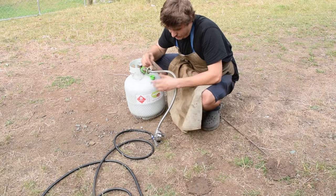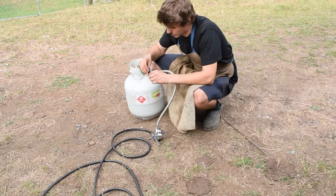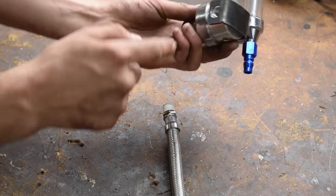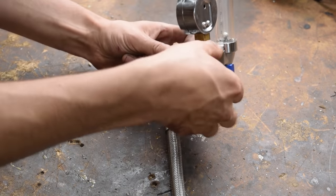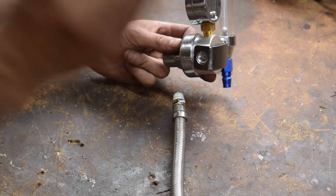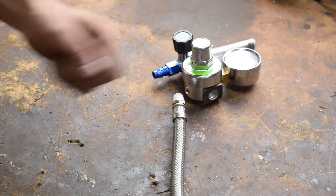The last thing to solve is the regulator — it's been sitting on the ground for testing. I'm going to make a bracket that lets it clip to the top of the tank. The bracket is held in by the threads on each side through a hole. It will be loosely fitting, which is actually good because we can thread the BSP fittings properly all the way in so the threads seal correctly.